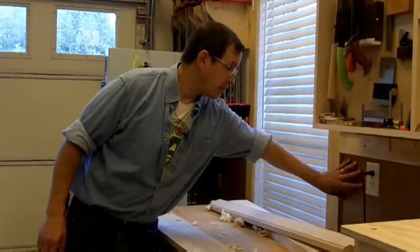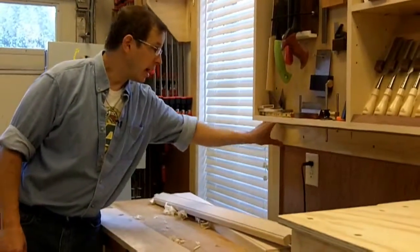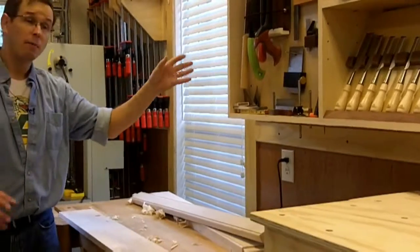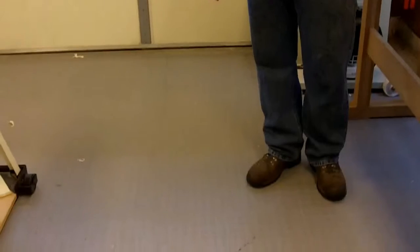That's going to be messy work. Electricians are going to do a lot of trenching — they're going to have to drill through studs. Once he's done, you can start working on the finishing touches. In this case, I used just quarter-inch Luan to cover up the trenching. I trimmed everything out with the same three-quarter-inch ply that was used to make most of the cabinets, put a little paint on the walls, and wrapped it up with a nice vinyl interlocking floor.